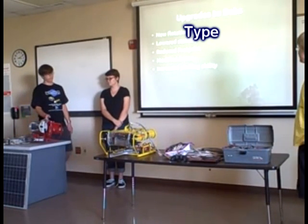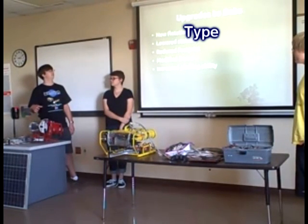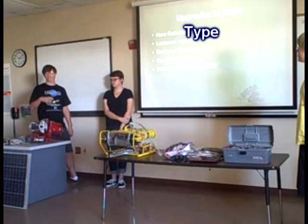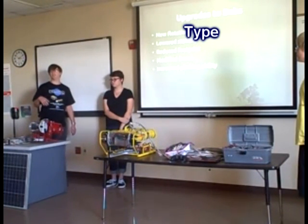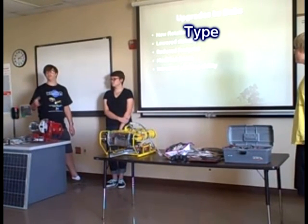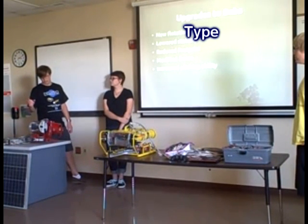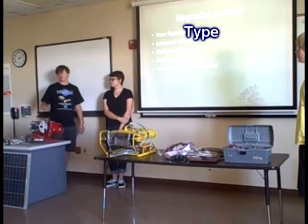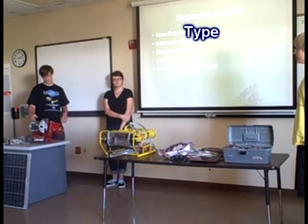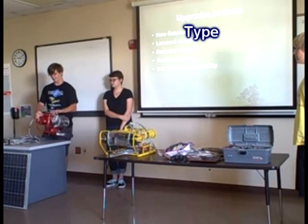For Babs, we initially looked at creating a new claw because grabbing life forms and putting them into the isolation pool seems like it would require a 3rd degree of freedom, so not only closing and twisting, but also kind of an elbow, I guess, or a shoulder. But then after looking at it, we decided it would make more sense to position the vertical thrusters further forward and backwards and change the controls so that we could just pitch the whole robot like that.